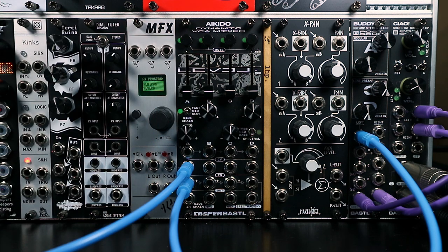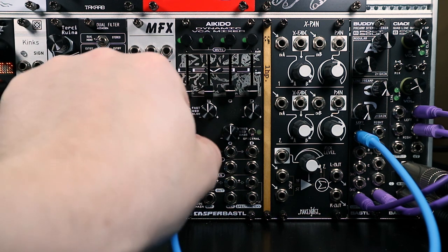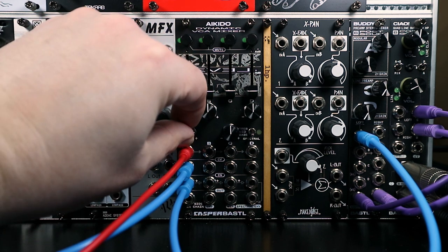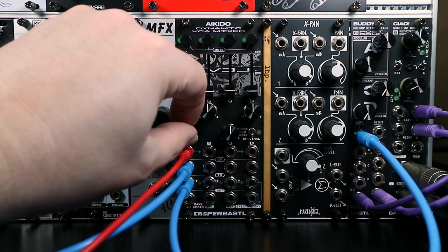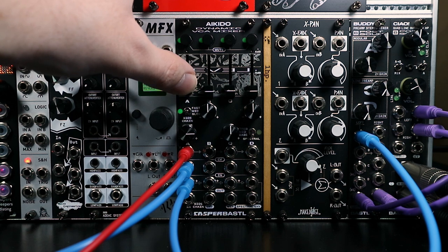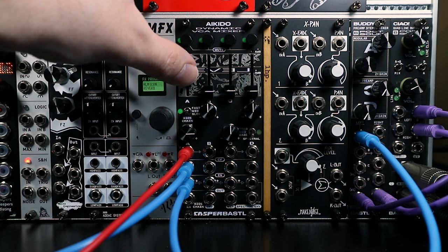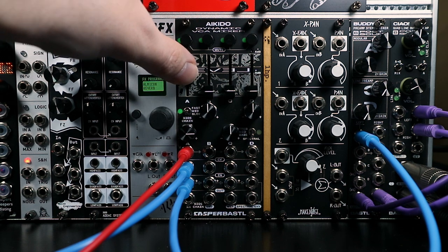More likely, with the attenuverter we're going to be plumbing in some CV. With an LFO patched in and the attenuverter turned up, we've got the LFO pumping away, and that's going to be relative to the initial level — so we can have the signal droning and then pushing up. And because we get saturation at the top end, you can actually get timbre changes just by using the VCA — it's a sort of basic wave shaper happening at the top, which is really cool.